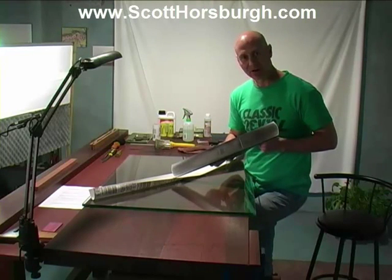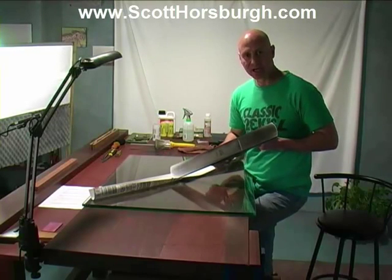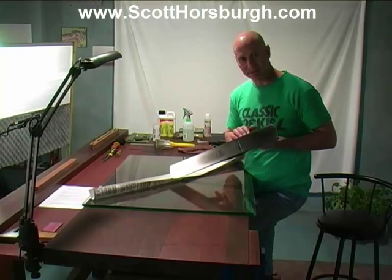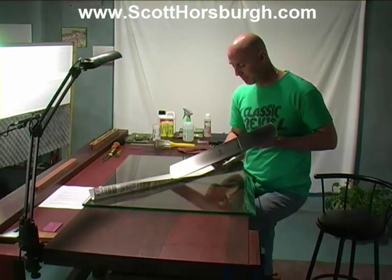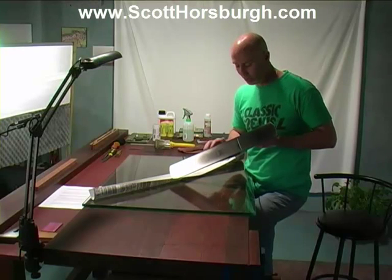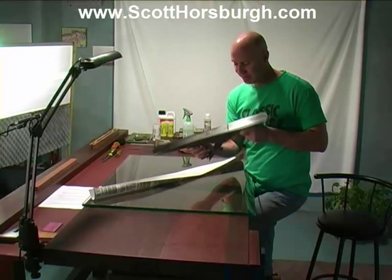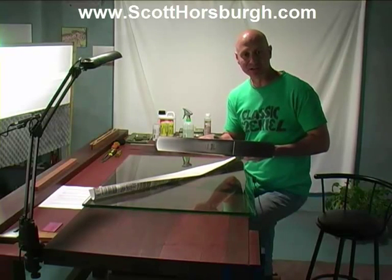There is one thing that I forgot to mention earlier. Before I actually started sanding this on the float glass, I just used some acetone and wire wool to remove the very thin coat of lacquer that comes when you buy a brand new plane to stop it rusting.